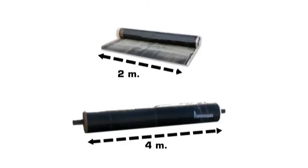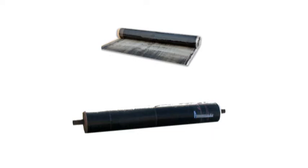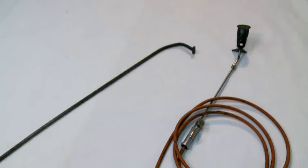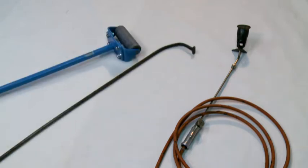The Terranap TP Geo Membrane is available in 2 widths: 2 m and 4 m. Use a propane gas torch with a nozzle diameter of 80 mm for welding the overlaps. To apply uniform pressure to the weld, use a roller of 15–20 cm wide and of a 10 kg weight.